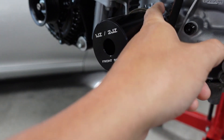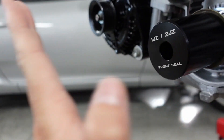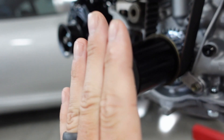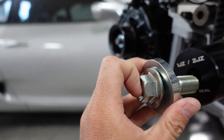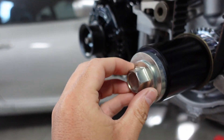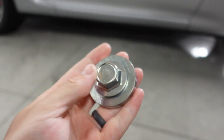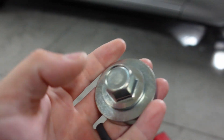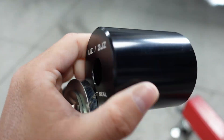You have two options here. With the bearing or gear out of the way it'd slide on further, but you have two options. One — if you have the seal in front and once it's lined up, you can hit the back of this with a rubber mallet and just press it in and it'll stop itself; it's designed to literally bottom out. Or the better way: once it's on there, take your bolt, seat it in, crank it down, spin it and it'll push the seal in. I think that's the better way. I really like that design. Very, very awesome design.